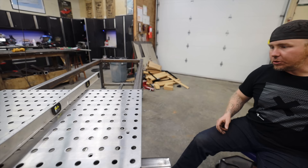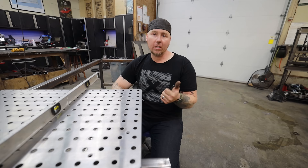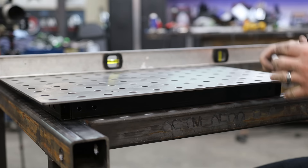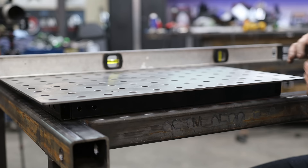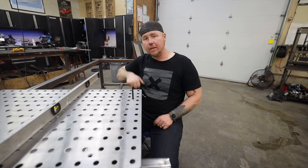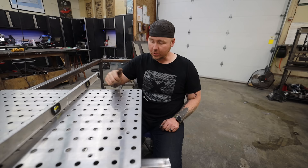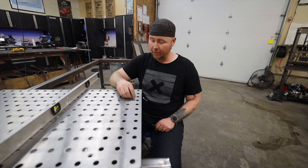The plan now is to bolt through this factory frame for a couple of reasons: one, convenience — I don't want to spend all weekend building the table; two, I wanted a heavy duty frame that's expandable down the line. For this stage, we're going to use a transfer punch to accurately transfer these holes down into our three sixteenths inch thick material, then tap it for the factory size hardware so we can reuse all this factory hardware — that's going to make this a lot cheaper than having to rebuy everything.